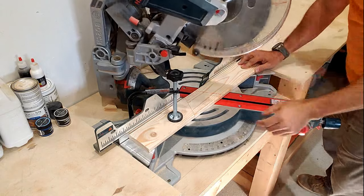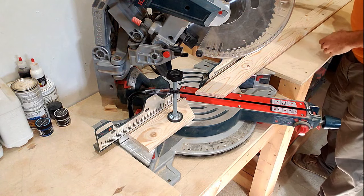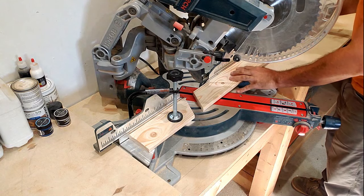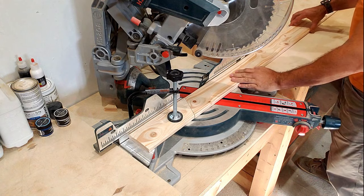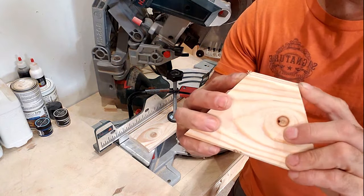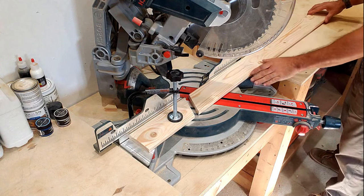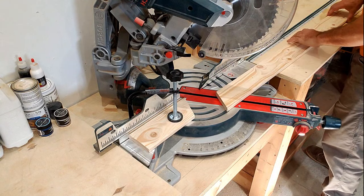Once you're happy with your setup, you can start cutting your pieces. You should have something that looks like a little pyramid piece without a top. Once you've done that you just flip your board over and continue with your cuts. Every once in a while it's a good idea to check that your pieces are cut similarly, because sometimes when you have an off-cut piece clamped down and you're pushing against it one after another, you can slowly distance that piece and lose that exact measurement you were looking for. So keep your first one handy and measure every tenth or twentieth piece down the road to make sure you haven't moved that piece. Once you're happy, you can continue on making cut after cut. This made pretty short work of it — it was a pretty good setup.